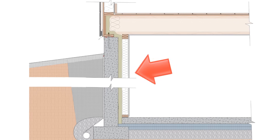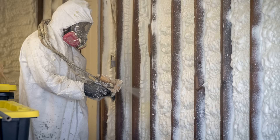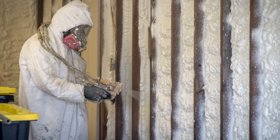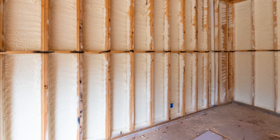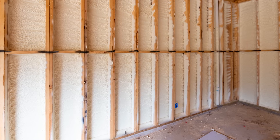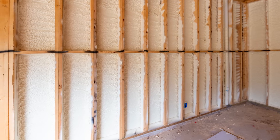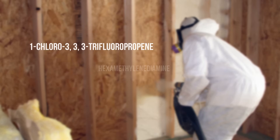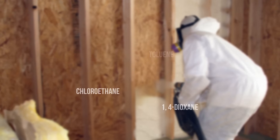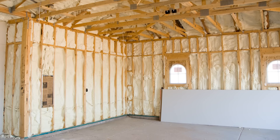You can also simplify this process by installing closed-cell spray foam against the foundation walls, as closed-cell spray foam serves as a class-2 vapor retarder, an air barrier, and has a high R-value per inch — not to mention it can be installed as a monolithic layer. It must be medium to high-density closed-cell spray foam, as open-cell foam is way too permeable. However, keep in mind that spray foam can off-gas some nasty chemicals for an extended period of time, sometimes many months after the initial installation.